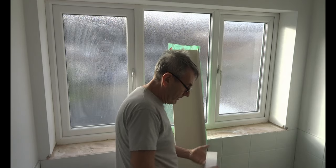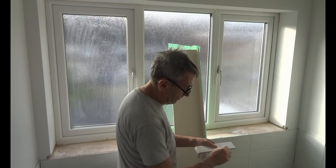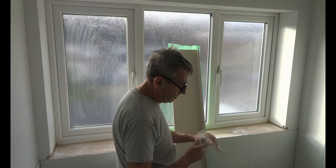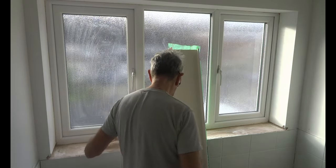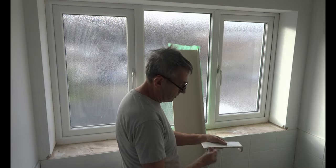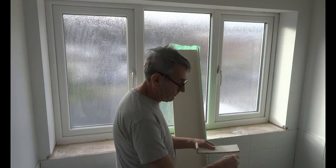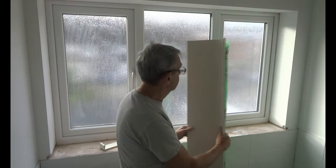The saw blades on that. If you've got a jigsaw, because a jigsaw works back to front, it pulls out and chips it all off the edge there. So a jigsaw, you have to do it upside down. Just on the top. Same with circular saw. Circular saw comes this way, so it chips all that finished edge off. So if you're doing a circular saw, you have to do it back to front.